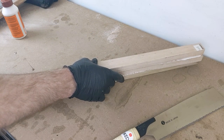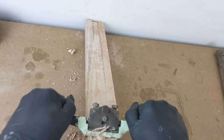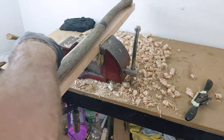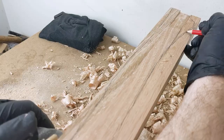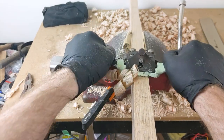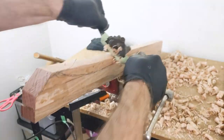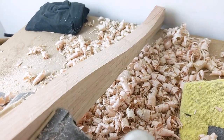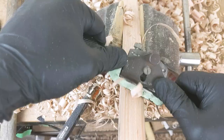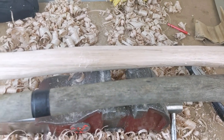Make sure not to over-clamp the timber as you can squeeze too much glue out, making a dry joint. I decided to keep the curved handle with a fawn's foot end — I like the way they feel and they look nice as well. I'm doing a lot of the work with a spokeshave. When sharpened properly they can make life so much easier and will reduce the amount of sanding needed later on. On the downside I feel like I should have left the material a bit thicker in places, but we'll see how we go.